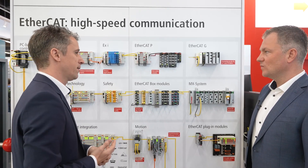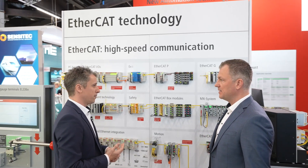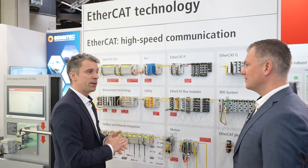And if you don't want a control cabinet at all, you use our MX system — and in all cases everything is connected by EtherCAT. For high accuracy in time synchronization you don't have to do anything, because inside EtherCAT we have something called distributed clocks. Every EtherCAT device has its own clock and EtherCAT synchronizes them for you, so you can always be sure that measurements taken at different places are captured at the same moment in time.